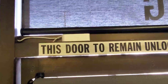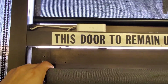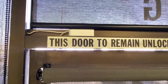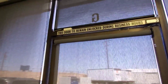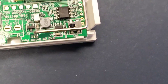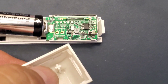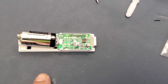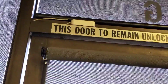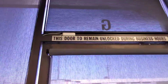The contacts are right there and the magnet is right under it. One thing I found out: if you get a tamper alarm, there's a little micro switch labeled SW3. You have to make sure the inside of the cover is pressing that switch down, or else it reports as tampered. I had to put tape around the connections inside because I nicked a little bit of the insulation.